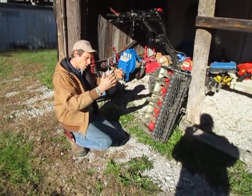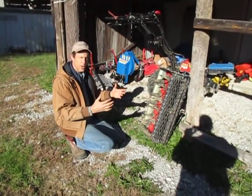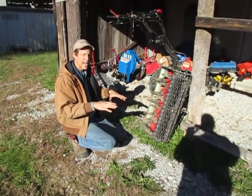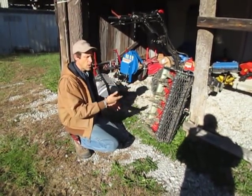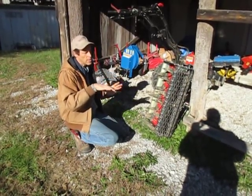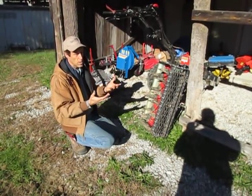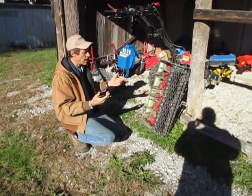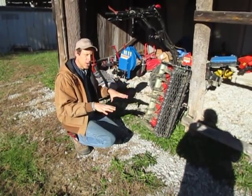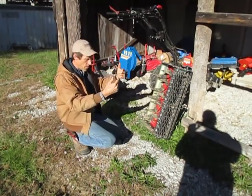Also, when you're stirring the soil layers continually like you would with a tiller in your cultivation process, the other thing you have to deal with is bringing up weed seeds that might be buried down in the till. For example, if your primary tillage was done with a rotary plow or moldboard plow, and it turned over the soil and buried weed seeds that were on the surface, you really don't want those brought back up to the surface by your secondary tillage methods where they can re-sprout. So the Power Harrow leaves those down in the soil profile — it just mixes things horizontally, not vertically.